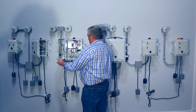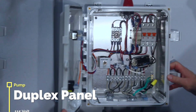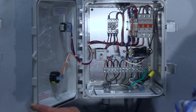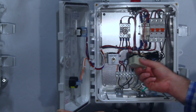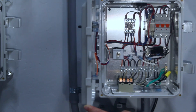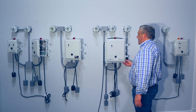This is a 115-volt duplex panel. We had to rob some parts out of this to help a customer out during a shortage, but this is a 115-volt panel with a simple controller. It's got two contactors — 20-amp contactors — and they're solid state, so they don't make a bunch of noise. This is a duplex panel for 115 volts.